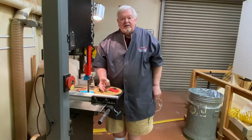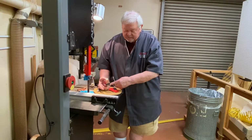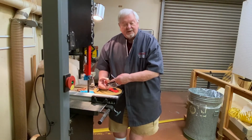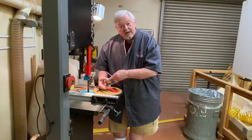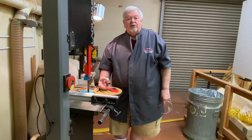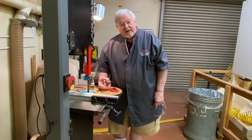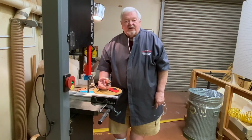The next step then is to glue those onto face plates, glue this on, square it up, glue this next piece on with veneer in between, pressure, clamp, square it up. Meanwhile, on the second faceplate, I'm building down from there. Building down from the top, up from the bottom. And once I have those components all glued together, we're ready to go to the lathe and make a vessel. Well, I prepped one already. So let's go back to the lathe. I'll show you my tools and the setup, and let's make a little vessel.